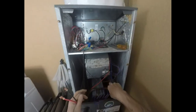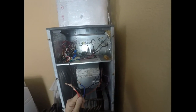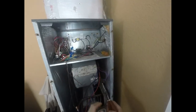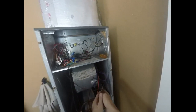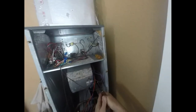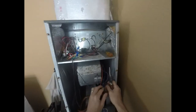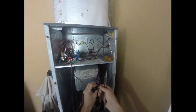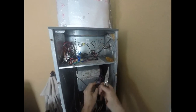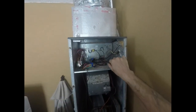So now we've got our three speed controls to the fan motor disconnected, and now we need to get the capacitor disconnected. Don't forget to annotate this. We'll pull that out of there. Now we are electrically disconnected.